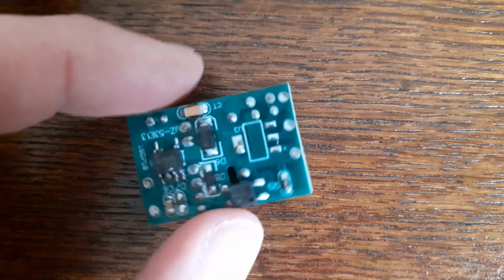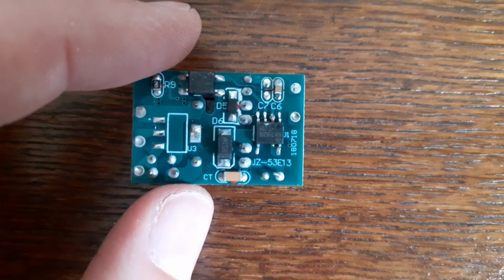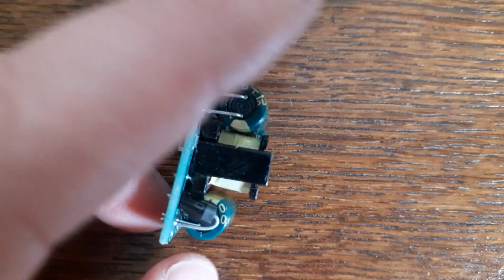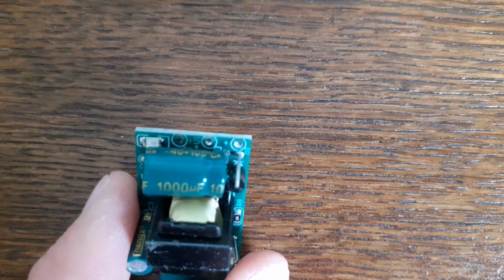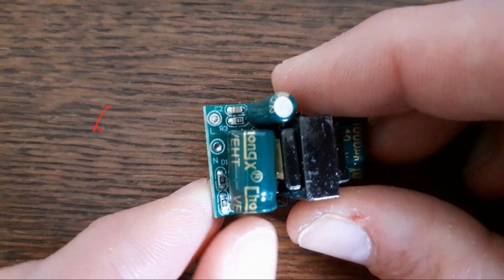This should be more than enough, since we will drive at most 16 LEDs at the same time, making only 16 times 20 milliamps, which is 320 milliamps. However, the power supply is connected directly to the grid, which is actually very dangerous. If you would come into contact with one of those bare leads, it could kill you. So I take real good care that does not happen.